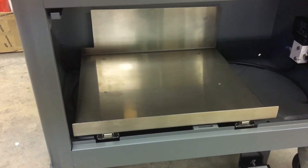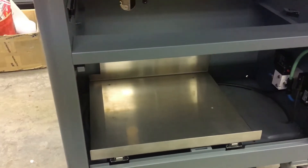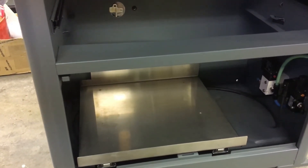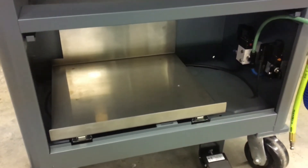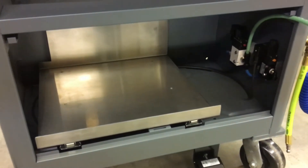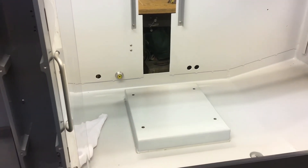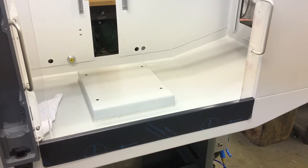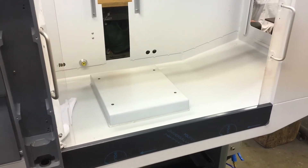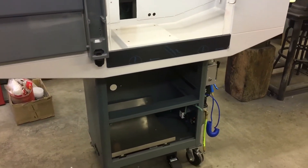The pump is small as well — I got both of them for free, so I decided to use them. But with the Little Giant pump you've got to pay attention to the lift rating, because the specs always say 10 million gallons at zero feet of lift. I'm always surprised — like, I got an 800 GPH pump, and it's like, Jesus Christ. But if you want some flow and to wash chips out of there, you need to be up in at least the quarter, third, half horsepower range. I hope that's some inspiration for whatever it's worth — it's just one guy's interpretation of a machine.